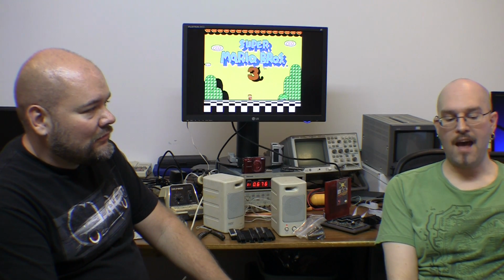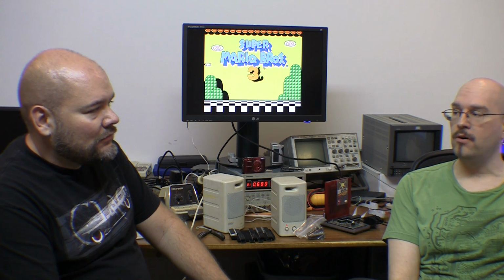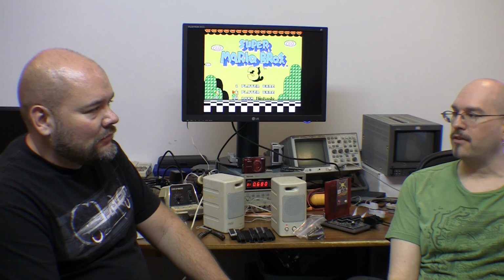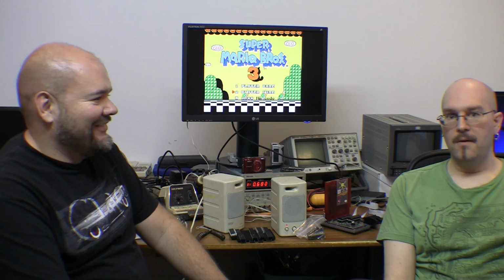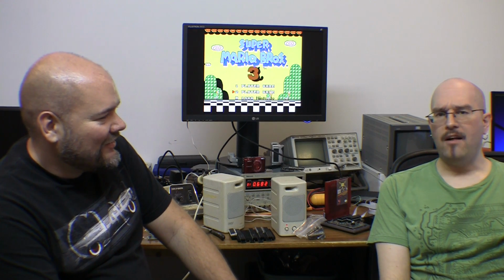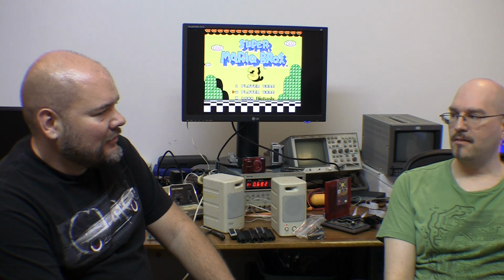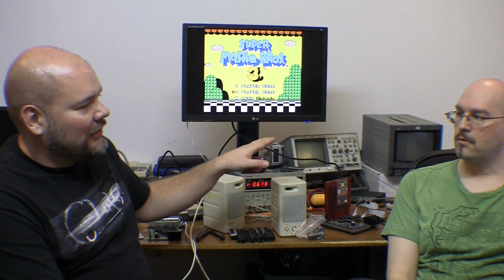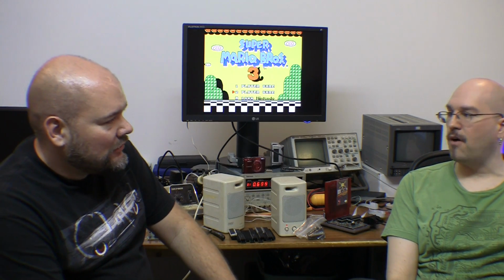Right now, what I have set up is I'm going to make it so palettes are updatable by the user if you have a PowerPak or an EverDrive, or even a cartridge, I guess, if you program an EEPROM, if you really want to go that far. So I was going to have up to, I think, 8 palettes. I was thinking 8, 4, 8. I mean, there's really no limit, other than how many you want to go through. So there's not going to be a selectable palette on the kit unless you... No, there is. I'll have a bunch of defaults in there.